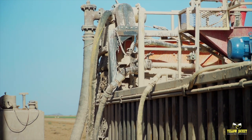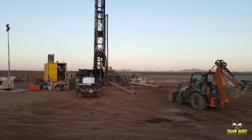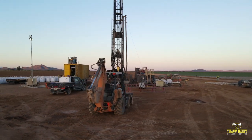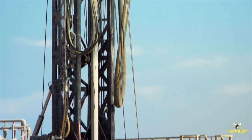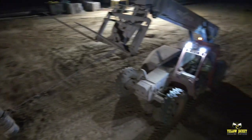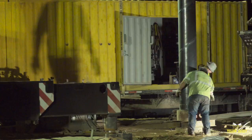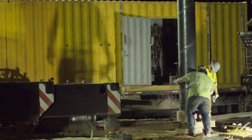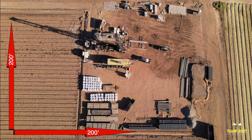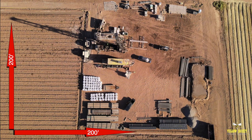The utilization of an above ground linear motion shaker versus an in-ground earth pit maintains a clean and organized site, allowing for uses in smaller, more confined areas where an in-ground earth pit would not be possible. This powerful rig is equipped with a detachable breakout table that hinges open for the removal of large tools. The back section retracts hydraulically, allowing for easy use of oversized reamers and bits while requiring less overall space. Yellow Jacket's carrier mounted Speedstar and its crew require an approximate footprint of 200 by 200 feet and can accommodate more restrictive sites as necessary.